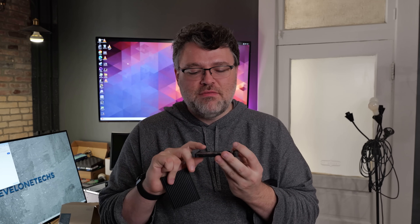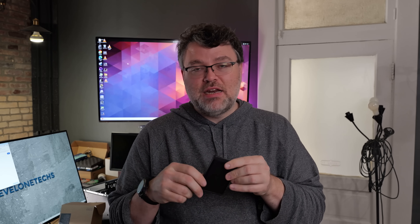The problem is when you start stringing Gen5 devices into adapters like this — your M.2 goes in, then the heatsink goes on, and it is quite a heatsink, and then this slides into your U.2 bay. When you've got Gen5 drives with a lot of adapters, you're potentially introducing errors or connectivity issues — is the drive okay, or is it the interconnects? I've had several of these in use with Samsung 990s for a database server with eight in an array as part of a cluster.